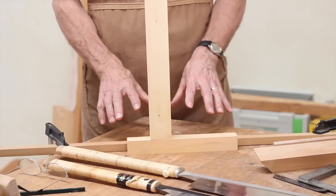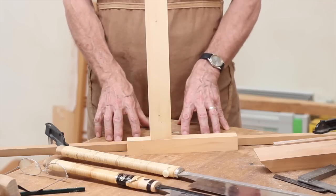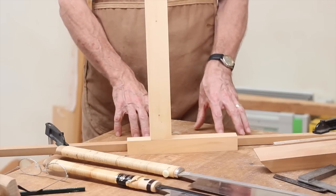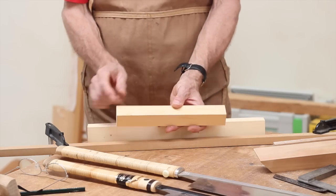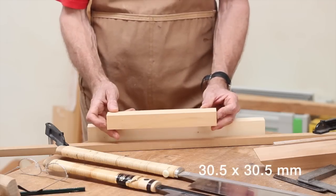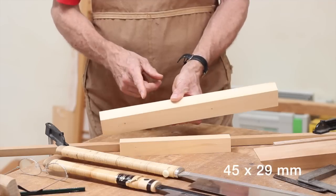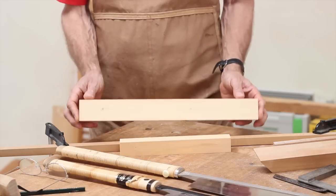The dimensions we use for these exercises are the same dimensions as those used in the Kanto region of Tokyo and its neighbouring prefectures. These are also the dimensions we'll be using for the shouji we make in the next video. For these exercises you'll need a piece of timber 30.5 millimetres by 30.5 millimetres — that will represent the stile — and another piece 45 millimetres by 29 millimetres, which will represent the rail.